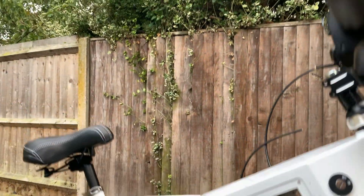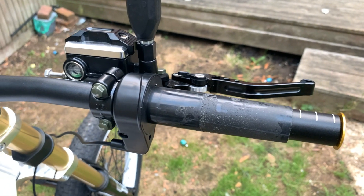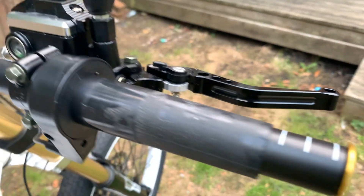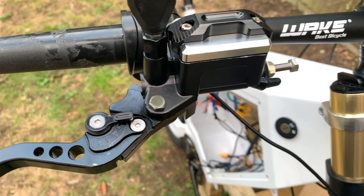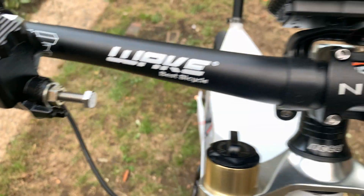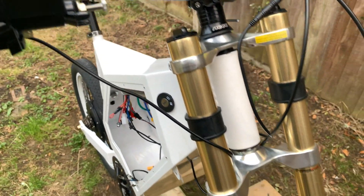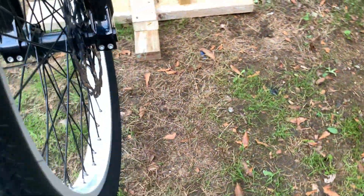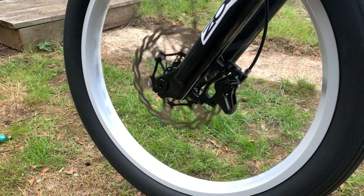I've decided to fit a set of motorbike hydraulic brake levers because the MSVA manual actually states that the brake levers need to have hydraulic oil level indicators. If you go with mountain bike levers with fluid level indicators, you're spending a lot more money. These set me back about just under £30. I bought the adapters off The E-Bike Nut — a great YouTuber with decent content — for about £10, though you will need M6 adapters to fit and squash the copper olive.